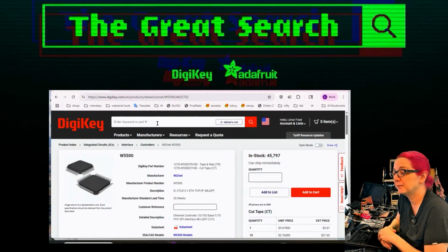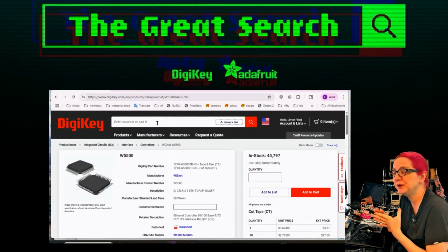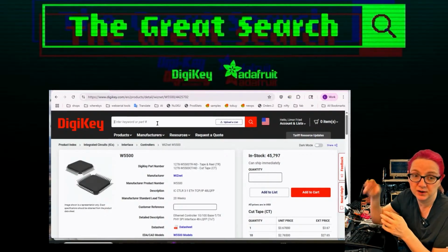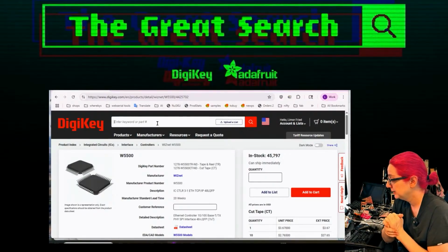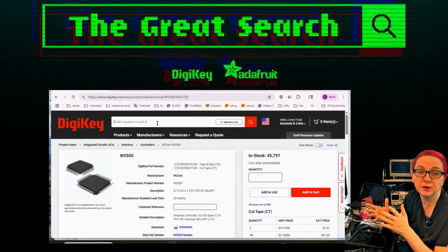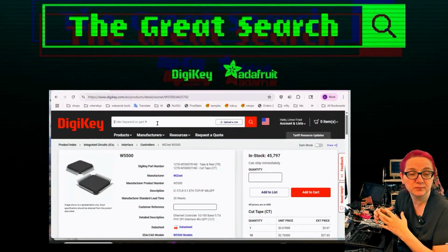And that way you could get 3.3 volts or 5 volts out. Usually PoE modules come in a couple of different options, but I just want to make sure that 3.3 volt and 5 volt are available, because then I could either pick and place it on or have it plug in. People can either stock it or get it from DigiKey, or get it on their own. And then suddenly you've got PoE supported hardware, and you just plug something in. And we have PoE in this house because we finally did it right.